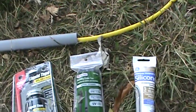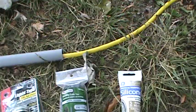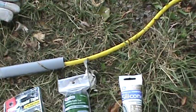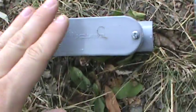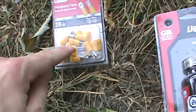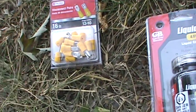Now we're going to look over the components you'll need to join together a union within your piping. If you don't have enough length of wire or if you have an extremely long span, you're going to need to join them together at some point. What you'll need is a junction box or a union box — this one obviously has to be three-quarter inch. Then you'll need some pins to join the wires together, or you can use twist wire caps. That's up to you.